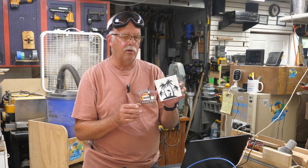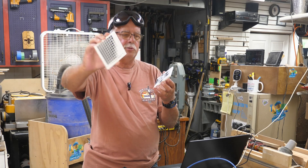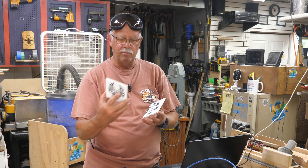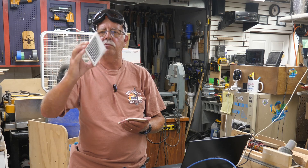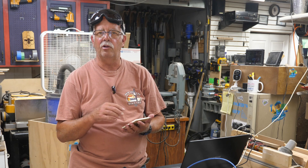So what you do is look at your test grid, and that's the way you can get your power and speed settings for engraving if you're making coasters or emblems. The Nicky Norton white tile test grid is available all over the internet — there are a lot of places to download it. But when it was made, it was designed for 5 watt lasers. Using it with a 10 watt works fine. You can even push it up to 20 watt. But when you get into 30 watt and 40 watt, it will just burn and you don't really get a good result.